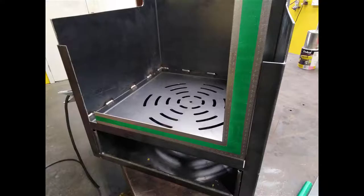So get your stitch welds in there, and then you need to clean it up with a repurposed file to get rid of all the spatter off the weld. Might even be able to get in there with the orbital sander and clean the surface up as well. Just give it a good tidy up. From this point, we are working towards putting the 6mm top on.